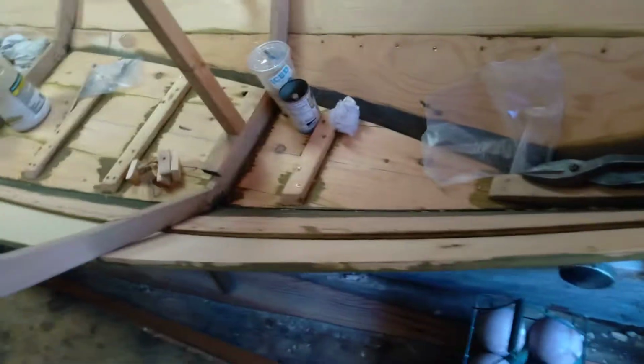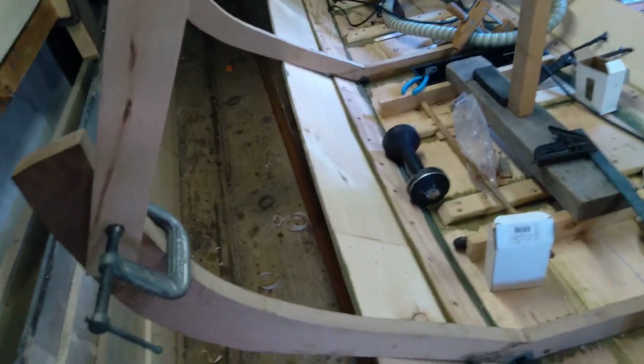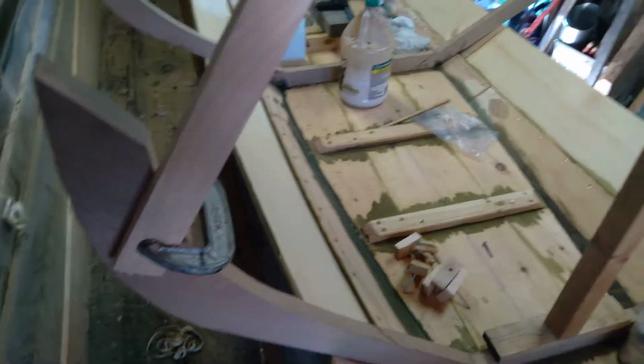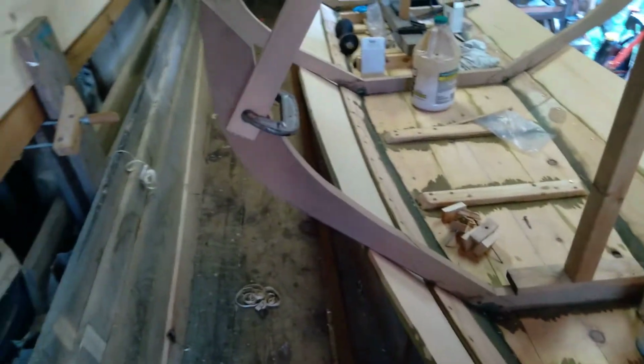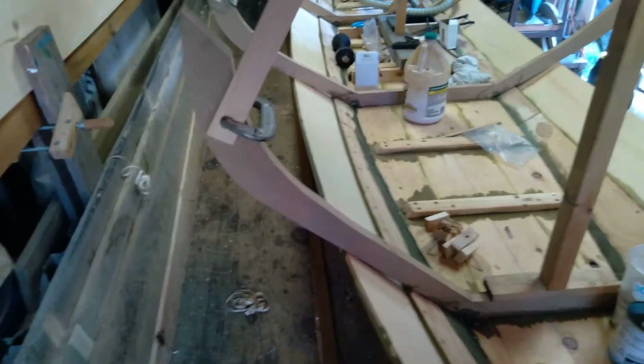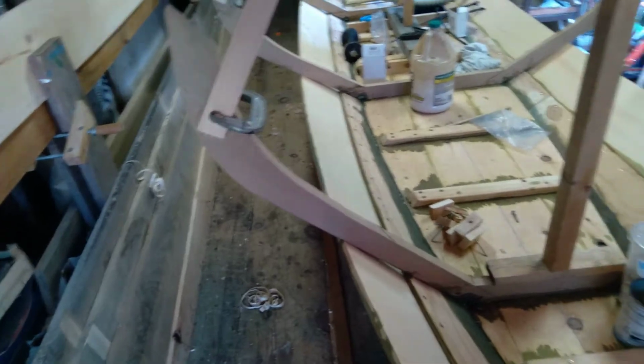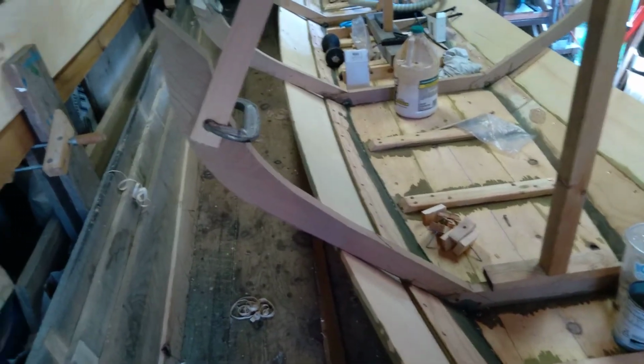Like, this garboard here is 15 inches wide. Now some of the boards, like the garboard on Samson Boat Co., might be 15 inches, but these boards are also only half an inch thick, or 5/8 thick. So they're much thinner. So the ratio, the scaled shape of these boards is far different than what those guys are building with. And those guys are edge setting their boards.